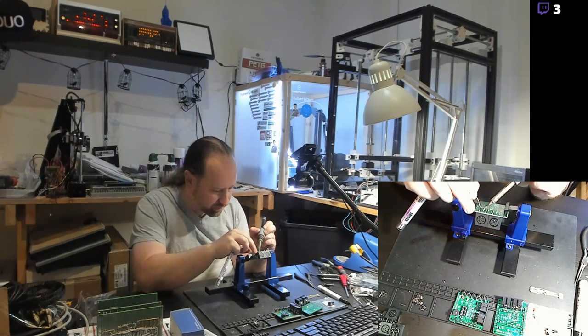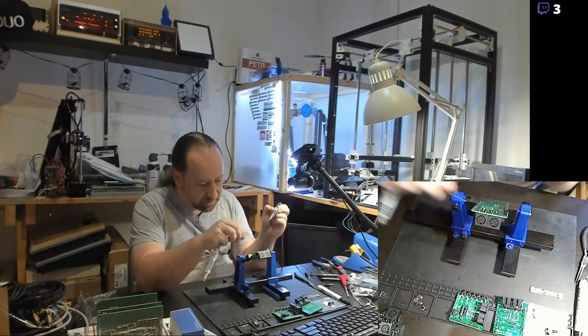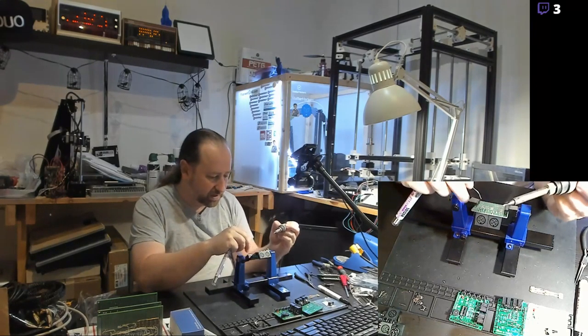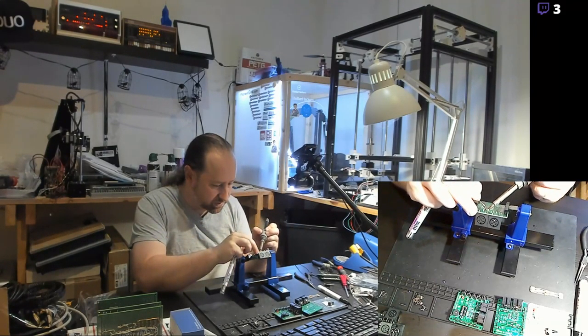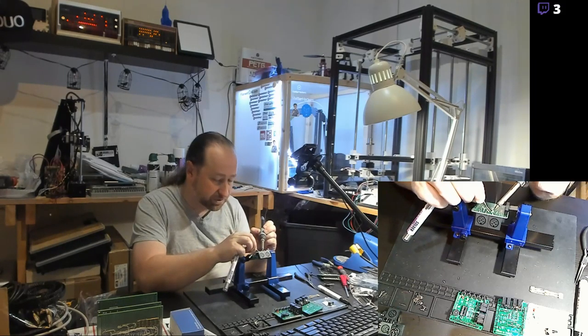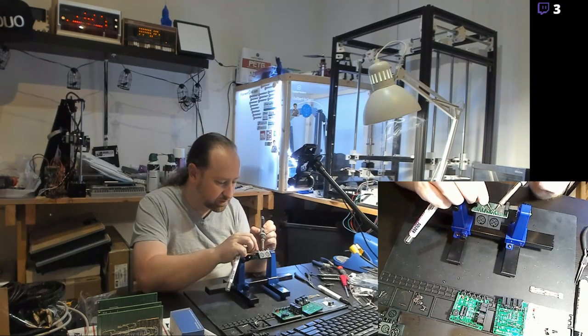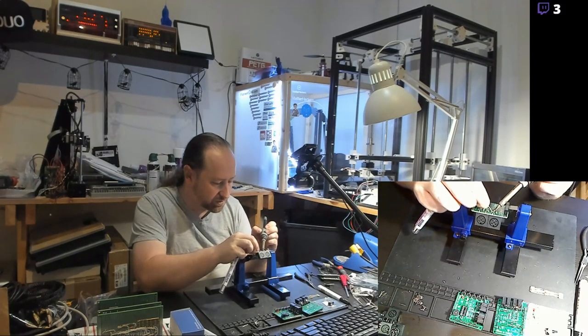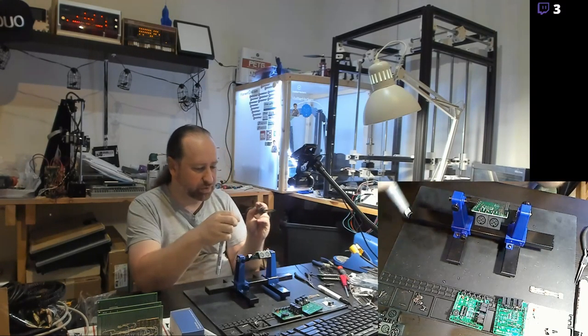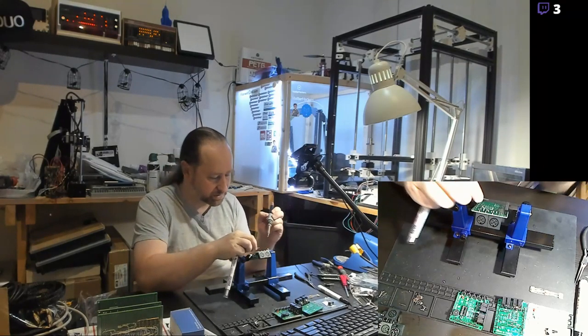So the better version of the build is actually this version, and there's a driver chip that gets mounted on the board. It's the exact same driver chip that Commodore uses. It's a TTL chip, a 7406, and the Commodores use that exact same chip to do their bus driving as well. More power, yeah, absolutely, more power, and it also takes the load away from the Raspberry Pi and puts it on a chip that's in a socket that's real easy to replace.